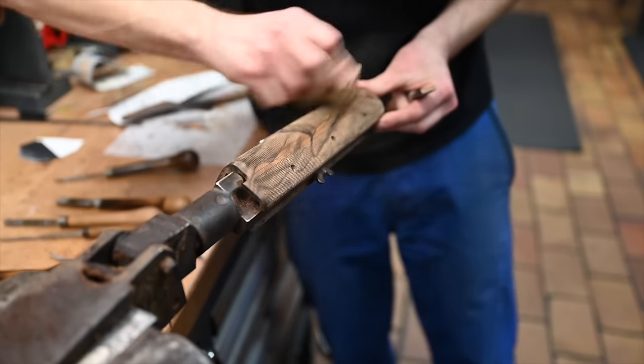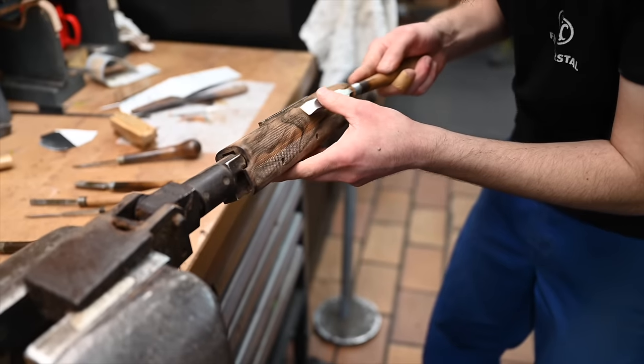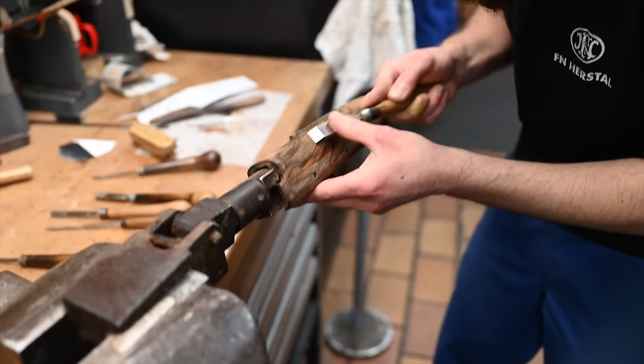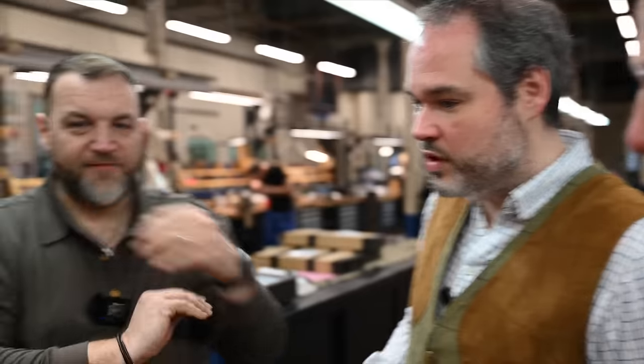So, at what point do you actually cut the fore-end in half? That one is a B15, it's a dummy three pieces. On the B15, but we propose it only on certain B25, that line is only a cut done by the checkering tool. On the real three pieces form, as we just saw at the stocking, it's cut from the very beginning. And how fine do you have to make that cut, because it fits together almost frictionlessly? It's not the way it's done. We cut it, and then we do the fitting with the file.